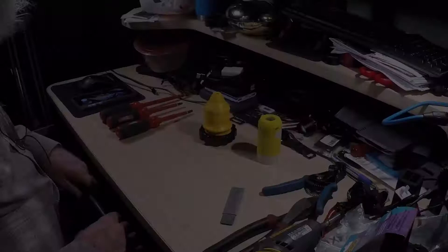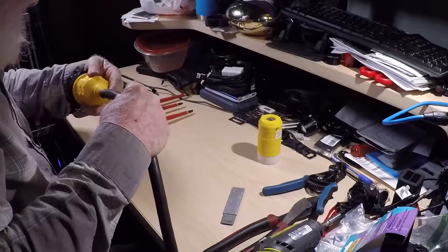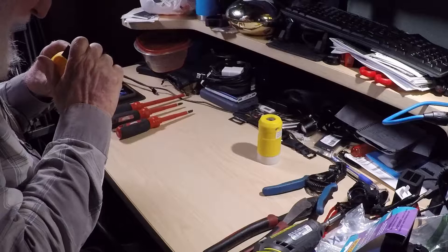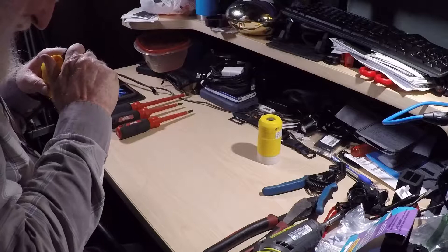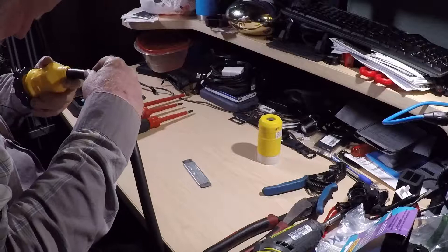Install part one complete. Now to build the power cable. The receptacle is installed on the trailer. Step two is installing the plug. We check this out and we can tell right away that the cable is not going to fit in that hole. So we're going to see if we can attempt to not do any grievous bodily injury while we adjust this. Let's see if it'll fit — it will. So we will install the plug on the cable.